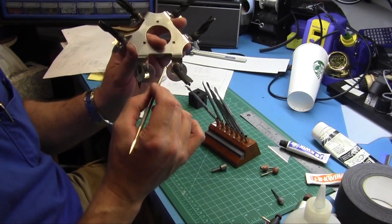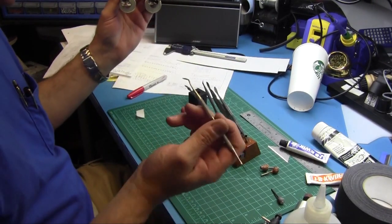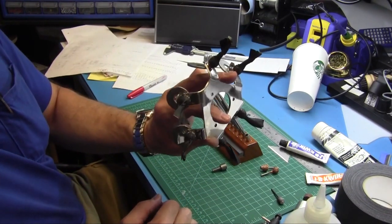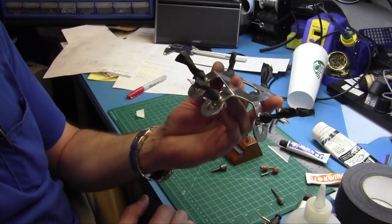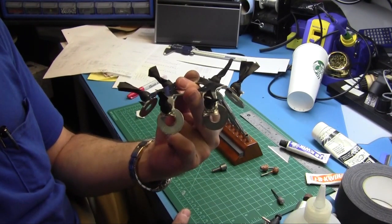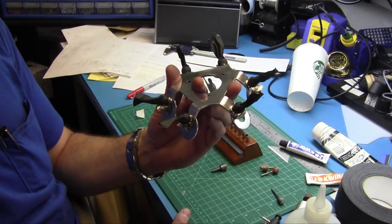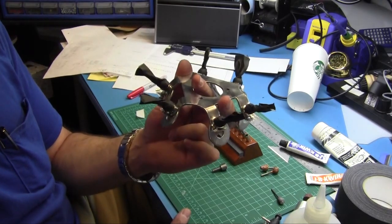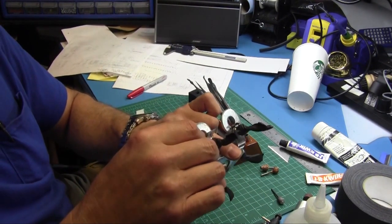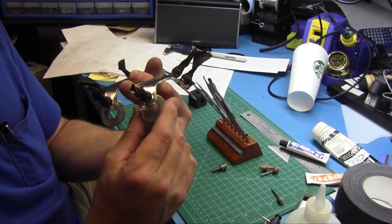What I do is I can go around and, while it's still in a semi-soft state, go ahead and just clean up the balls a little bit. Also, another good thing — because this being magnetic — you can take a toothpick, just make it to a sharp point, and clean up a little bit of the excess, then pull the tape off and really do a good job. Anyway, this thing was really easy to make. I'll show you what I got in the way of a dimple die to do this. I used it in a pneumatic squeeze for building an airplane, but I think you could just trim off the studs on it and use it in a regular bench vise.